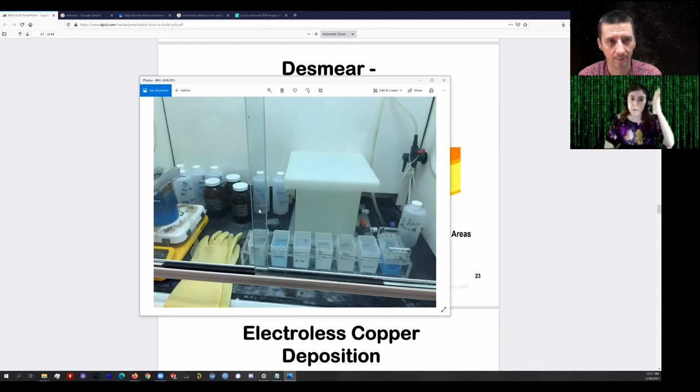And this is when something very interesting happens. We put it into a bath of silver ions. Most silver salts are insoluble in water; silver nitrate is one of the few that's water soluble. So this is a solution of silver nitrate in dilute nitric acid. The silver ions, Ag+, will associate with the tin and actually remove electrons from the tin. The Ag+ will become silver metal. So this is a key component of redox chemistry — we have copper ions that go into solution, then deposit on the board and become copper metal. Copper ions in solution are blue; copper metal is a sort of pink, peachy color.